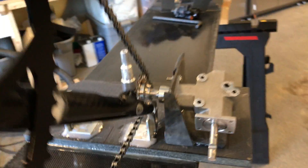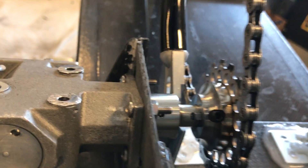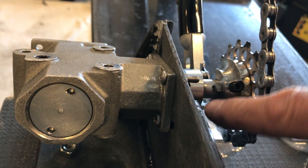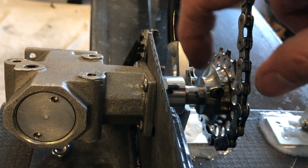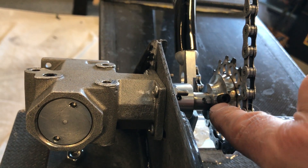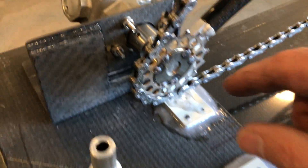Probably overkill — I could probably put a bigger gearbox on there and it would still be okay. What we did previously is I had my machinist buddy Manny make me some couplers. This coupler just fits over another coupler which fits onto the gearbox shaft, and there's a keyway and a key in there, and a grub screw goes in and pushes on the key to keep that in place.